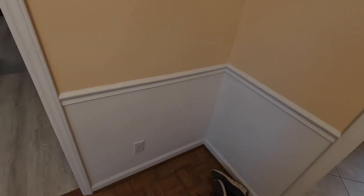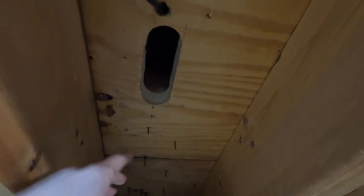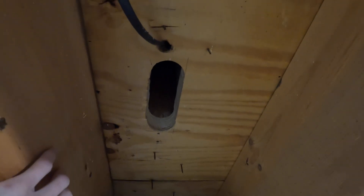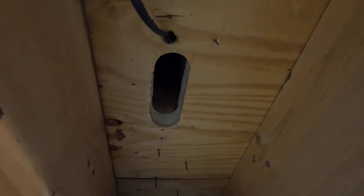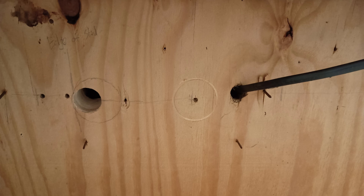The next tricky part is drilling into the wall. I know there is an outlet in the wall and the Romex is coming down from that outlet. I also see a row of nails in line with the Romex hole — together, this is a pretty good indicator of the center of the wall. I guess where the stud is based on the outlet and assume 16-inch centers, which means the edge of the next stud should be 14.5 inches over. I drill 1/4-inch holes and use a bent piece of coat hanger to find the edge of the stud. I missed on the other side of the stud with my first hole, then hit the stud, and drilled two more holes that were on the correct side, with the last one perfectly against the stud. Then I used a 1-1/2-inch hole saw to get a better look and confirm I was in the center of the wall.